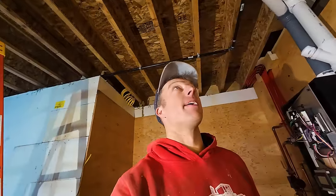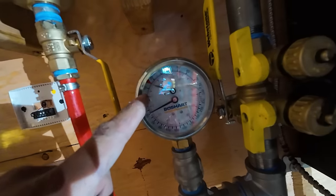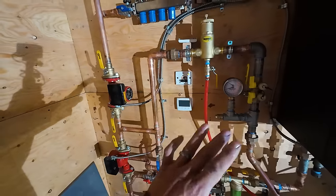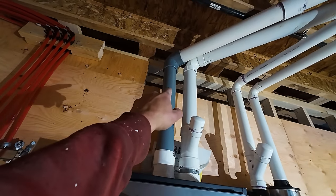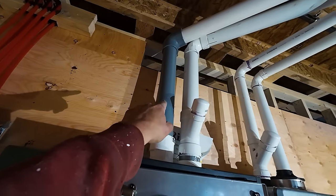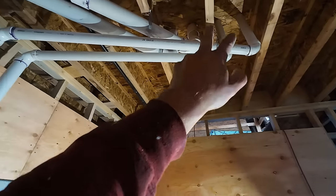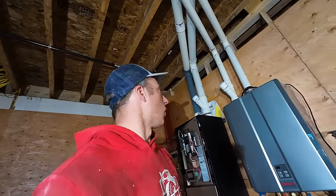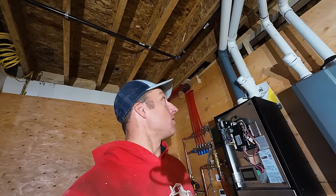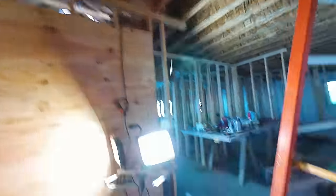Still in the mechanical room — it's maintaining pressure at 15 PSI with zero leaks. I just finished putting in the schedule 40 CPVC high-temperature pipe for the 30 inches required out of this unit, then it transitions to schedule 40 PVC and runs up. I did the vent runs as well. According to the manual, this boiler can take schedule 40 PVC for both intake and exhaust. The CPVC is hard to come by in these parts, but they're all hung and strung to the wall.